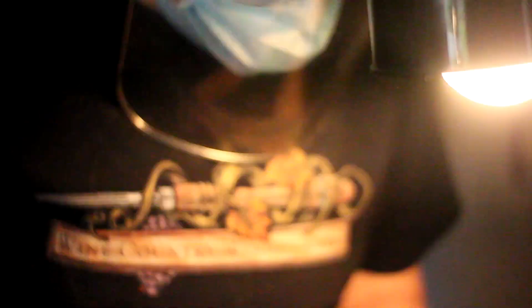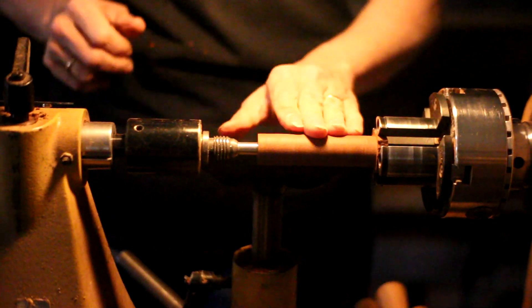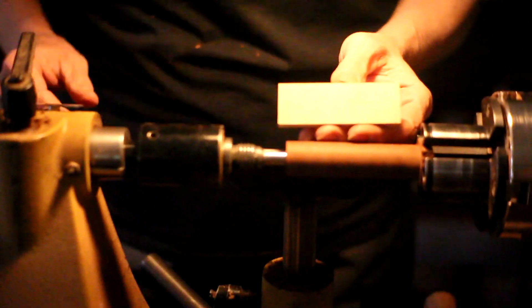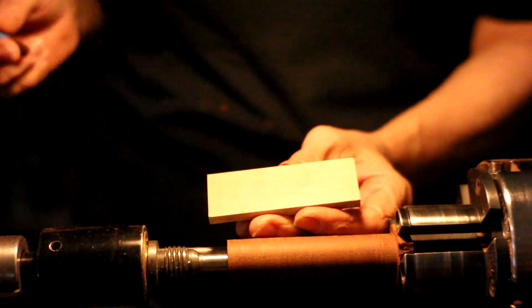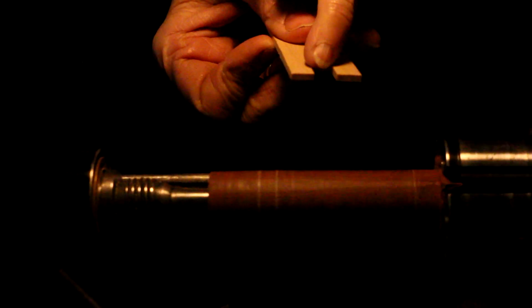Now I connect the dots. What I've got is a rough cylinder, so I'm going to mark the proportions of the peg. This shows the head, shaft length, and the position of this little collar right here — that's the underside of the head, the bottom of the collar, and the end of the shaft. I'm also going to mark the center line of the head, and I'll show you what that's for in a little bit.